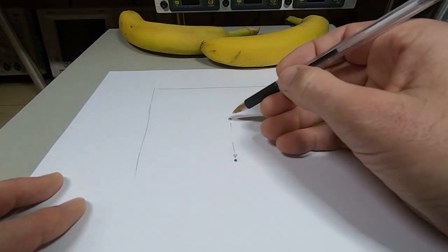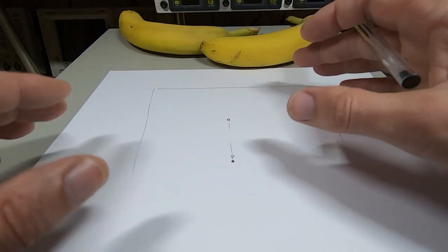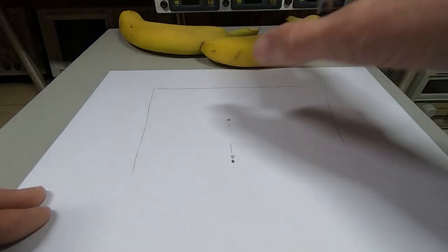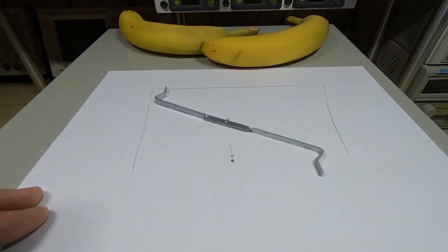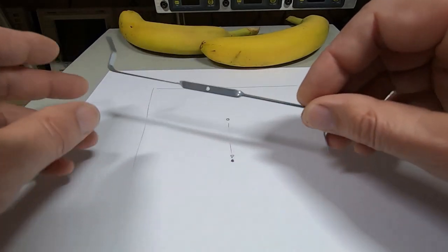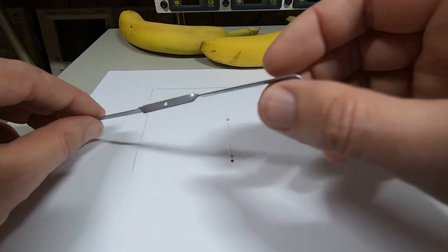And for the fan profile, what I found was we don't want to circulate a lot of air. What I wanted to do was to create a lot of turbulence, but slow moving turbulence. I didn't want it to be blasting and blowing air around the chamber. So what I ended up with was a fan blade that looks like this. This is just a copy, so exactly the same as what's fitted into this machine. So it's a bit of steel, and it's bent so it's very nearly at right angles.